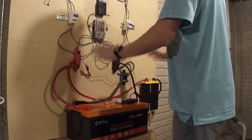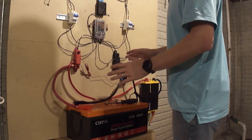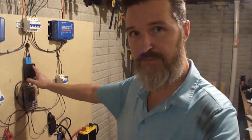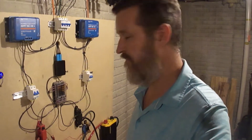It's dark outside so we're not getting any energy anyway. Tomorrow my solar panels should be able to charge up this battery all the way up to 14.2, and then from there it will float at 13.8. Right now it's at 13.15 volts, and my inverter is turned off. The only thing that's on is my Raspberry Pi, which is using about three watts — for a 300 amp hour 12 volt battery I don't think it'll cause too much damage. So tomorrow I'm going to let my solar panels charge this thing up.